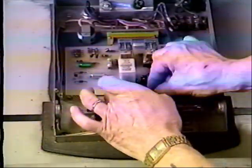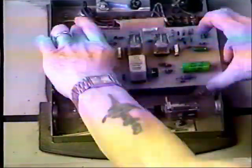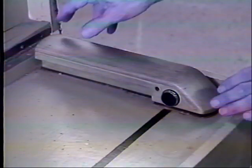All of the controlling mechanism is on a circuit board. Simply by loosening a screw and removing a bracket, the entire circuit board can be removed, making troubleshooting very simple. With this unit, on the opposite side of the lane there will be a photo cell. This completes our overview of ball returns and foul detectors. For more detailed information, you're invited to attend our training program in Richmond, Virginia.